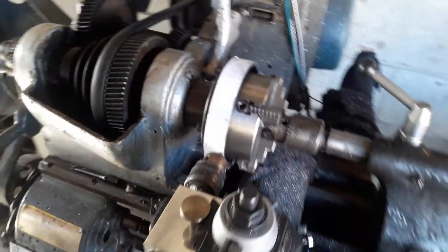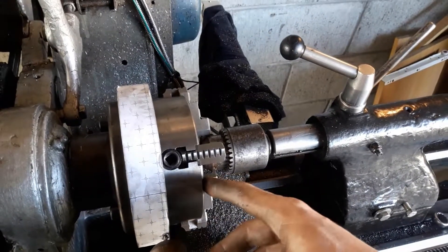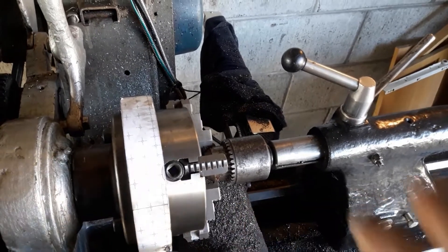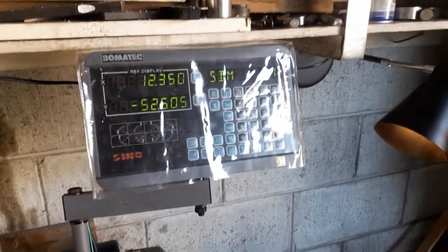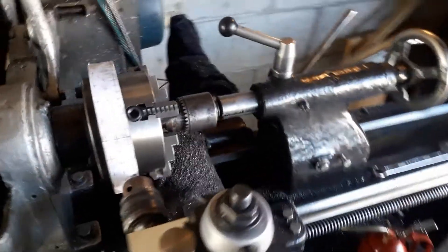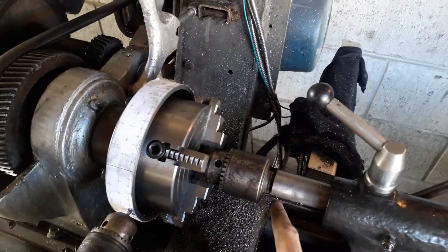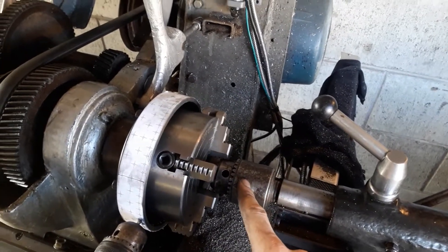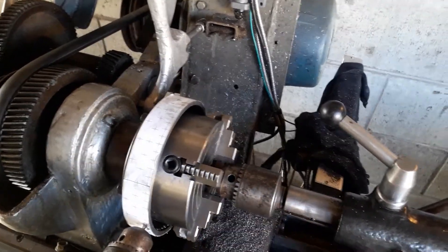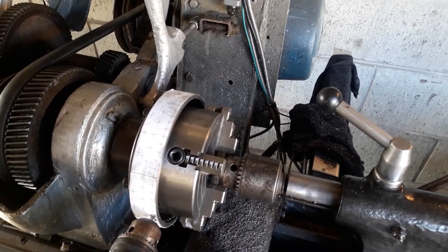Now I'm basically rotating the wheel, centering the drill on the point, and drilling through to a set depth on the DRO, then rotating and going in again. To create friction to stop it turning by itself, I'm just clamping it up a little bit against a drill chuck. Probably not the smartest way to do it, but it seems to actually work really well.